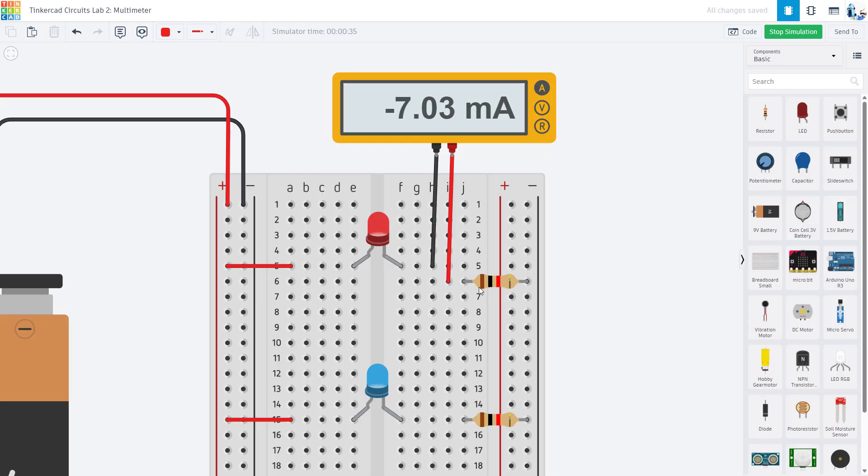I have a negative reading because of how I have the black and red leads connected — the black lead is on the positive side, which is about conventional current and sign convention covered in my intro circuit theory playlist. If I switch the leads so I have the red lead on the positive side and the black lead on the other, I get a positive number as expected for current flowing through the LED into the red lead into the meter and out through the black lead into the resistor.